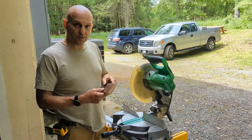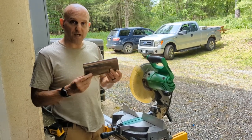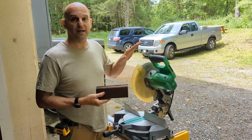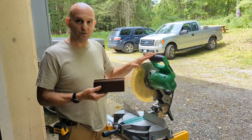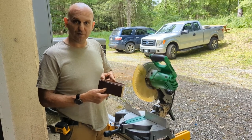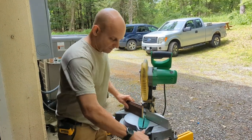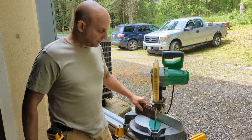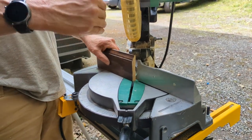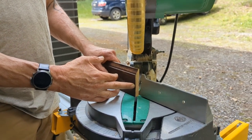The first thing we need to do is cut this back at a 45-degree angle. I cut this to size not just to illustrate one way to finish it, because whenever I am cutting angles on the saw, I always cut the length that I want it to first, and then I'm able to find that 45-degree angle a little bit more effectively. First thing you want to do is set the saw at a 45-degree angle. I'm going to start out with the saw blade out wide and then walk the cutting edge in until the edge finds the correct line.